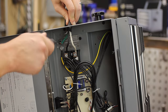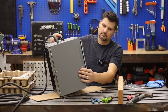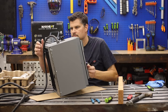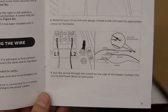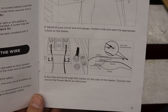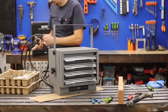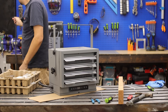Wiring up a 240-volt appliance or outlet is actually easier than 110, because your two leads coming out are both hot — that black and white wire are both running 120 volts — so it doesn't matter whether that's on leg one or leg two. Green is always ground. You will want some grommets and the conduit required per code in your city if you are doing it in its final resting place.